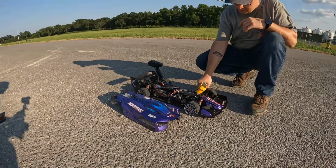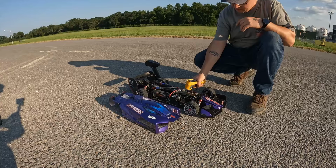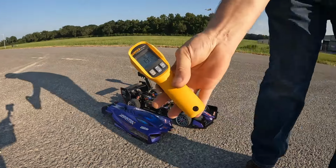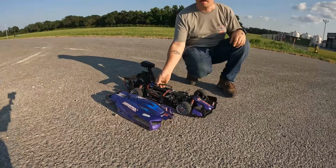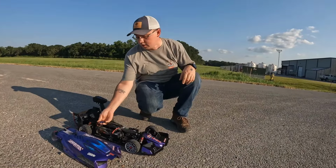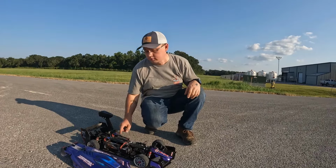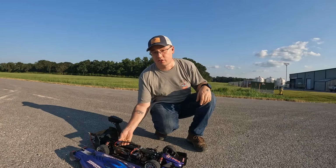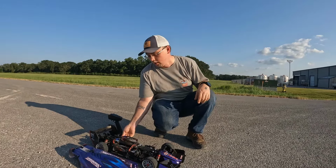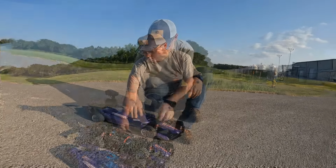Let's check the heat. So the highest that I'm seeing is 136. I've had a lot of people warn me about these IC5 connectors, saying that the XLX2 pulls too much current, way more than these connectors can handle. But I tell you right now, guys, these connectors, they're not warm. They're not warm at all. The wires are not warm. They're handling power just fine.